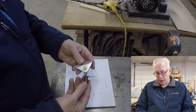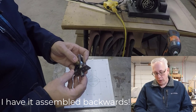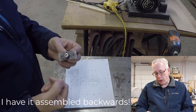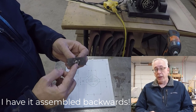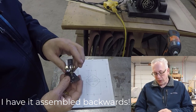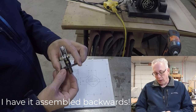And as you can see, I have one made here. We did this in two parts. One is the hinge plate, and we basically took a piece of rod, turned it on the lathe, and threaded it. I drilled a hole through it and threaded it for 1/4 28.